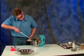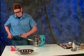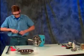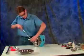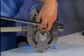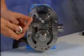Remove the rotor retaining nut of the horizontally oriented rotor. It's a good practice to avoid using a torque wrench for this. You might torque it out of calibration. Use a regular wrench or breaker bar. Lock the rotors in place with a nylon or hardwood dowel so you won't damage these parts. Each rotor nut has a Belleville washer and 2 O-rings.